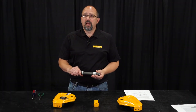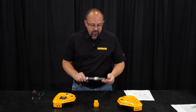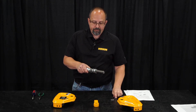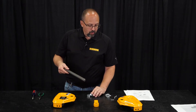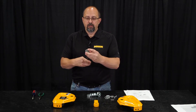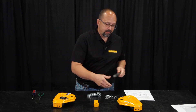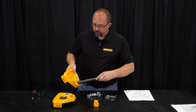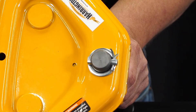After we've confirmed we have the correct number of spacers, setup is very simple. We're going to pull the split pin out of the retaining shaft and take all of our spacers off. We're always going to start with one thin spacer on the side of the pin that goes against side plate S or G — the side without the serial number. We'll take our suspension shaft, put it in, and make sure that the flat on the retaining pin is flat against the spacer.